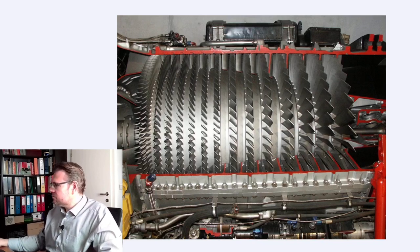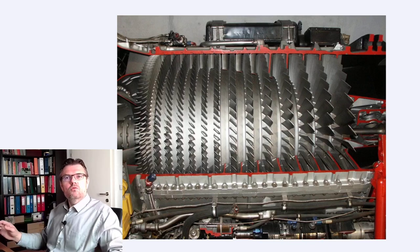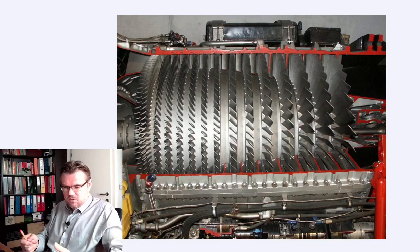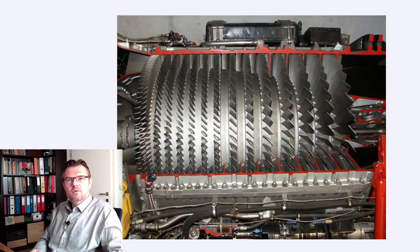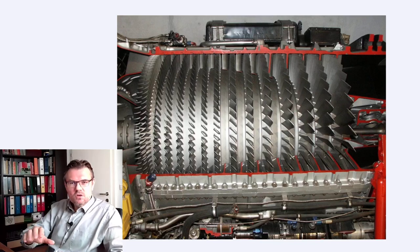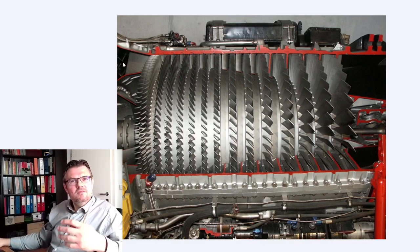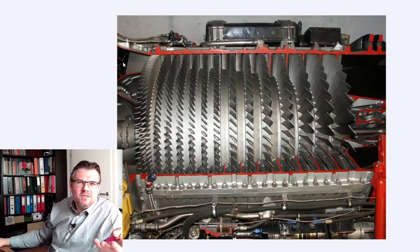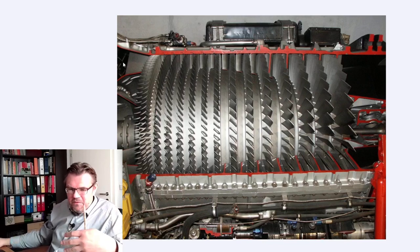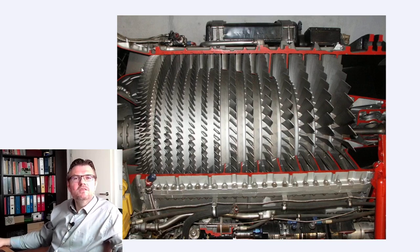Axial compressor is not only used in jet engines like these, but also used in static applications. We can reach up to 6 bars with them. So the main thing is we are adding kinetic energy, and because we block at the end, it's a congestion. There's simply streaming resistance. So this kinetic energy will be transferred to potential energy, to pressure energy.